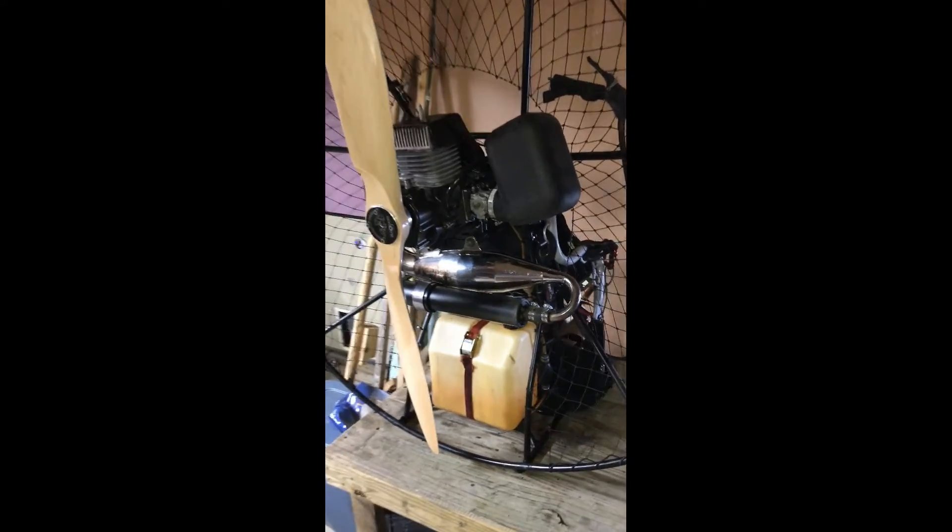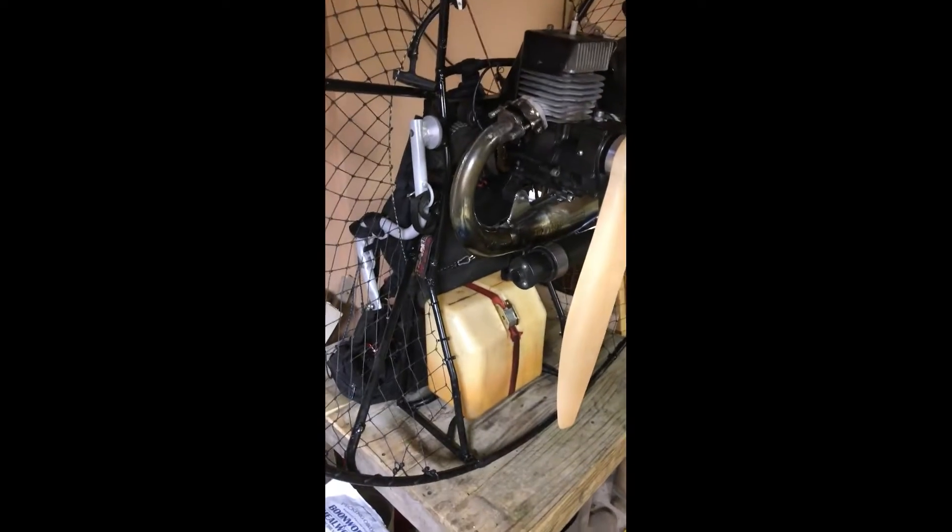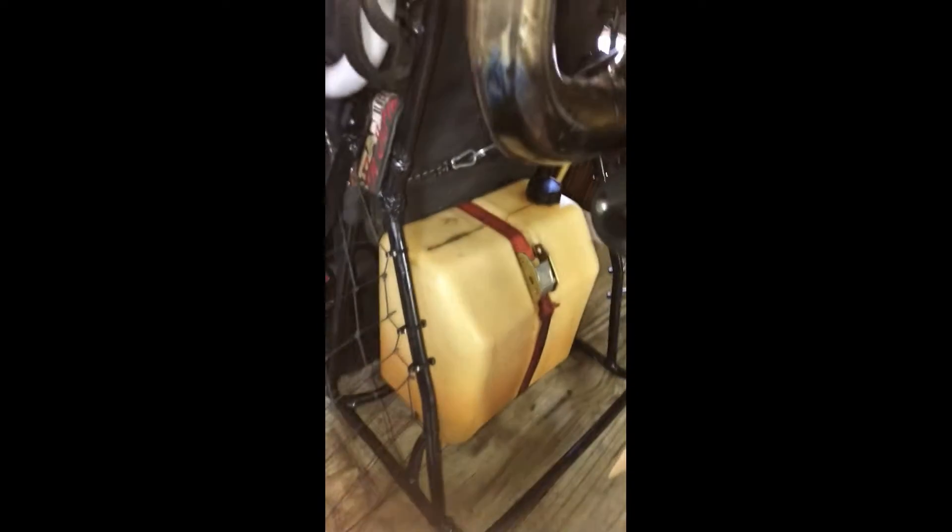Hey everybody, this thing's back together. I just gotta gas it up — it's ready to go. Got this brand new propeller, I'm not gonna break this one. So Alumaweld works okay, but this is a follow-up: the weld ended up breaking right here on that piece, and it was because of the tension I put on when I was pushing this in. It wasn't lined up perfect so I had to push it in this way, and then just overnight it cracked. So I redid this weld and now it's fine.